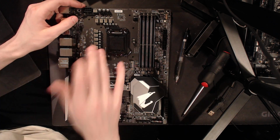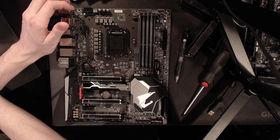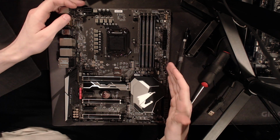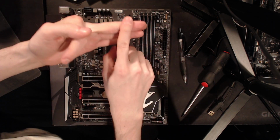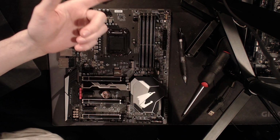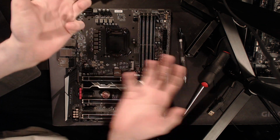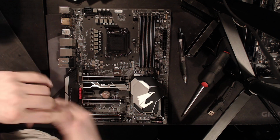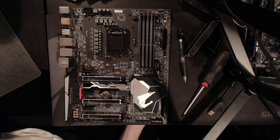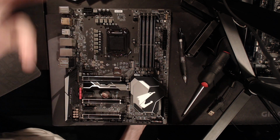That's a 60 amp power stage. It is not just your regular typical power stage, it is a smart power stage. The reason it's so smart is that it integrates things like temperature monitoring, temperature protection, current monitoring, and current protection, and well, that's basically it. There's not that much functionality that you can tack onto a VRM beyond the usual stuff.